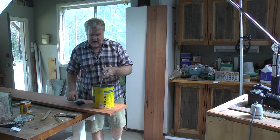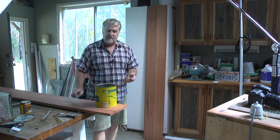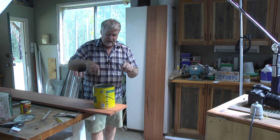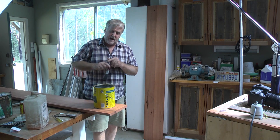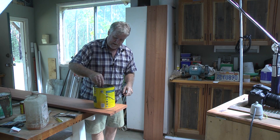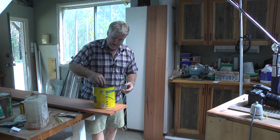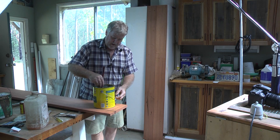What I've done — it's only half full, so I'm working out of that can. If this was full, I'd pour some out into another container to work out of, otherwise it's almost impossible. Because this has been sitting around a while, I had a little bit of a skin. I cut that skin off and put just a touch of turps in there. I haven't stirred it yet — I don't want to stir the whole thing through. I'm only going to stir the first inch and a half or so with the brush. You don't want it super thick. You want a nice working consistency.